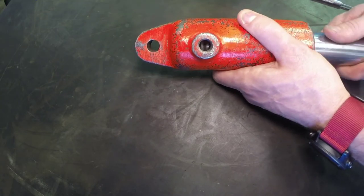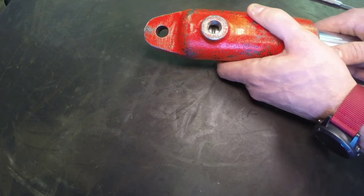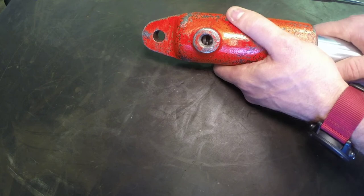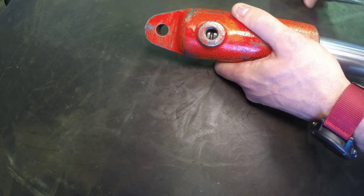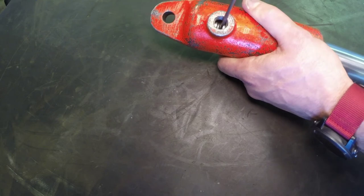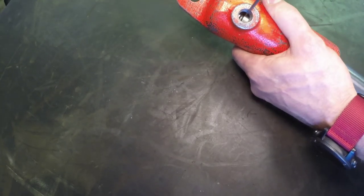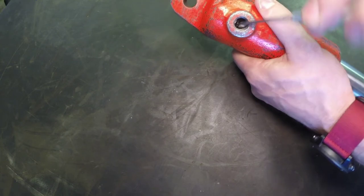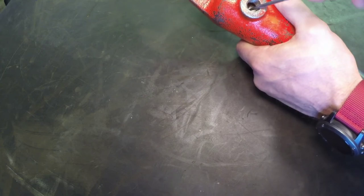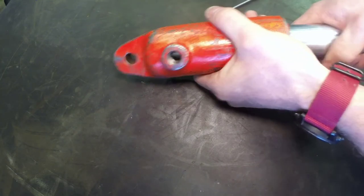You can see the end of the snap ring is just accessible. What you can do is get on it with a seal pick or a screwdriver and walk that snap ring off. If you rotate the cylinder at the same time, that snap ring will actually pop right off.